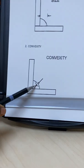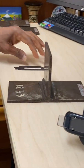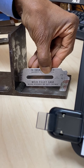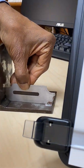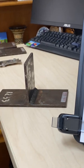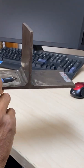The throat, which is right here, has to be more than the theoretical throat. This line represents the theoretical throat, and it should not be less than that. One way to check is a go-no-go gauge. If this weld is 5/16th inch, you can take the weld size measurement with this gauge, and for the throat you flip it and put it here — if there is a gap, that means there is insufficient throat.